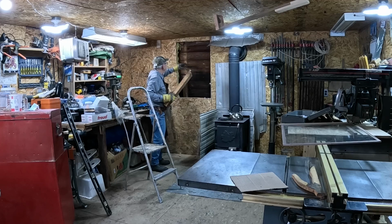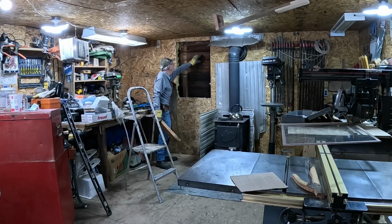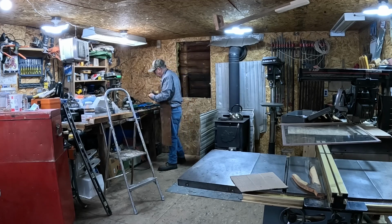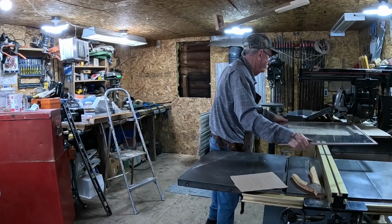That's okay. The problem that could arise is that when you're cutting these nails with a bit like I have, it'll cut wood and steel. The problem is you could get a spark in here, or up inside there, and you've got to watch all the time. If you're unsure that it's not sparking or anything that could catch a fire, just throw a little water on it before you cut it. Anyways, so this is where that window should go now.